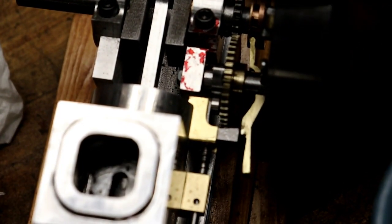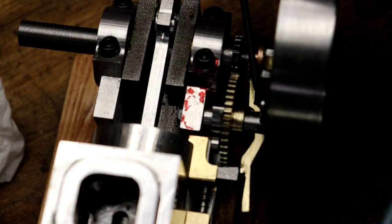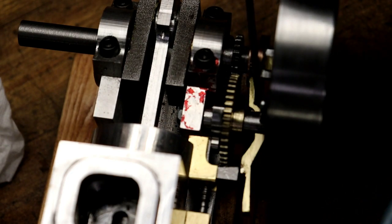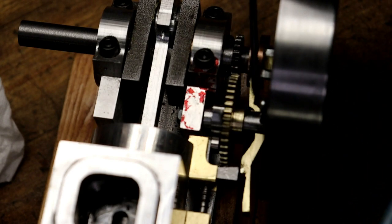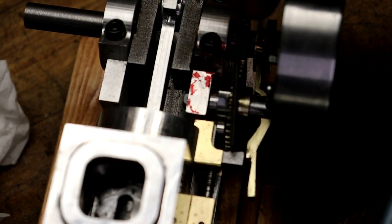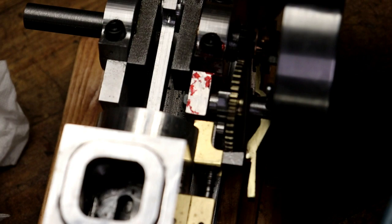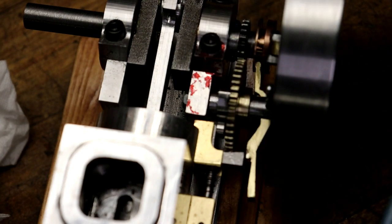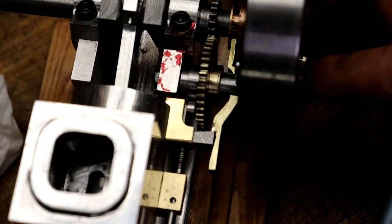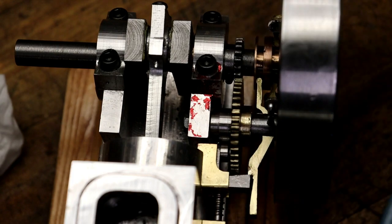This area right here on the drawing comes down at an angle - well that hits your weights and bracket. So I almost went straight across; I whittled on it. That was the first thing. Then when I got that, this notch back here was much too high - way too high - so I cut that down. Then I found that this front surface here was cut too far back so I had to add 50 thou to that. I engage the lever right now and you can see there's plenty of grip on it, but I had to do this to both of them.